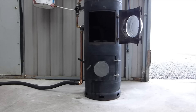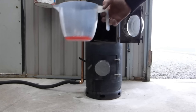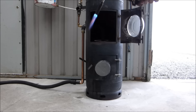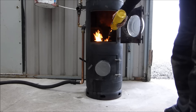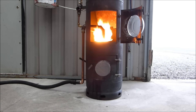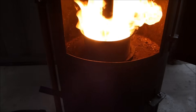I'm not sure how this is going to work out. But what I'm going to do is put in some kerosene and pour that into the pot. I didn't mean to put it all in, but it doesn't matter. Turbo torch — I'm going to actually light it. Let's get the kerosene hot enough to burn. There we go, it's kind of going on its own. And now I'm going to plug in the blower. You can see it has an instant effect on it. So this is with the door open — you can see that pipe is an inch off the floor of that pot. We'll close the door now — so that's it burning.